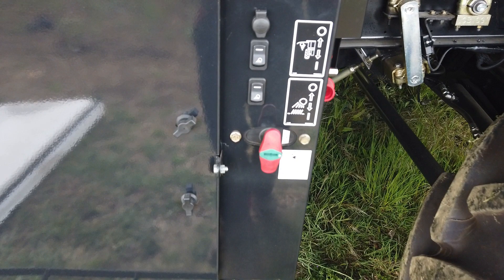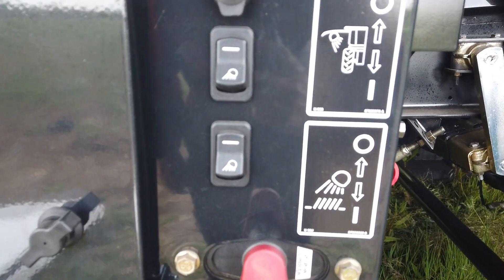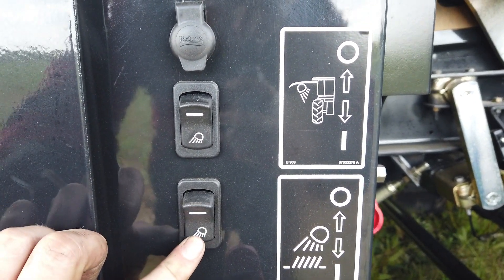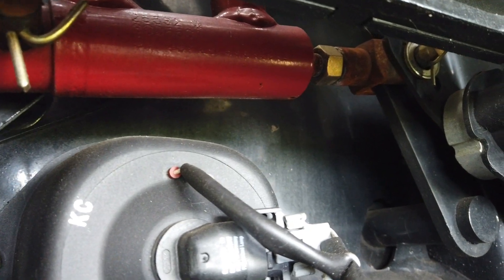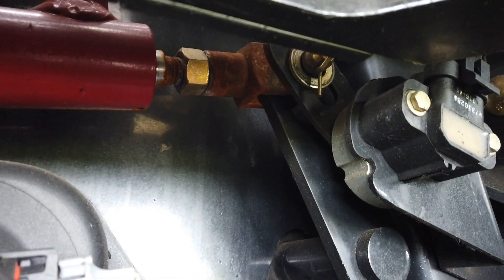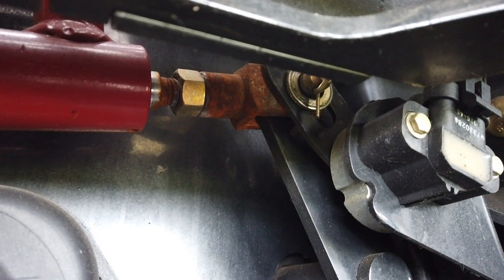Just above the battery isolator is a 12V power socket for use with an inspection light or similar instrument. Also, the underguard floodlight switch and the interior over-sieve work light switch are located here. Just above the batteries near the frame of the combine is a small hydraulic ram. This ram controls the position of the integral chopper fix knife and has up to five positions: out for swathing, 25% in, 50%, 75%, and 100% in for chopping. It is limited to out and 25% in when used in conjunction with the extra chop.